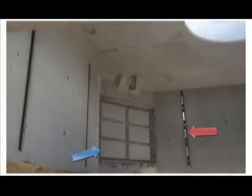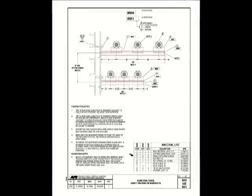Here's the hole where the men come through — there'll be a ladder mounted later. As you can see, we have two arrows: a red arrow and a blue arrow. The blue arrow shows the windows where the conduits come in; they'll break these out, install bell ends, and then glue the conduit inside the bell ends. The red arrow is pointing to the galvanized framing channel — this is where the cable racking arms go, and this is your cable racking standard.